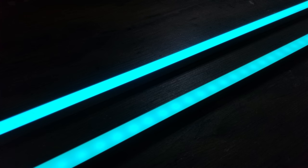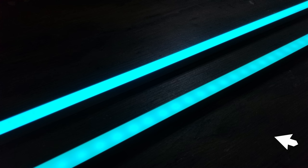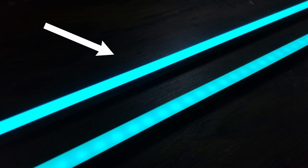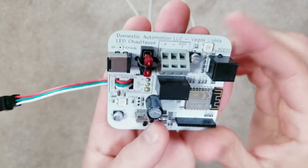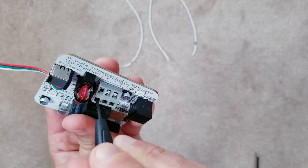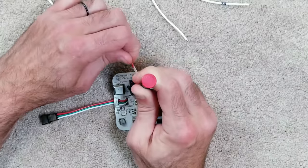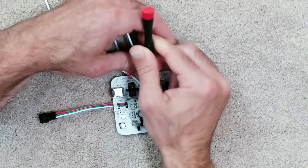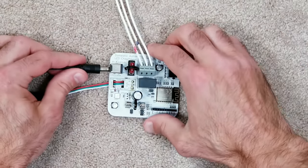In this video I'm using SK6812 LEDs with 60 LEDs per meter. These diffuser channels do a great job diffusing the light, but it's not quite perfectly diffused compared to a channel with a strip of 100 LEDs per meter. However, for longer installs, having a continuous diffuser cover makes this a great option. Finally, Domestic Automation now has boards built specifically for the SK6812 pixels I'm using, so if you want to simplify setup to a plug-and-play solution, I'll leave a link in the description.